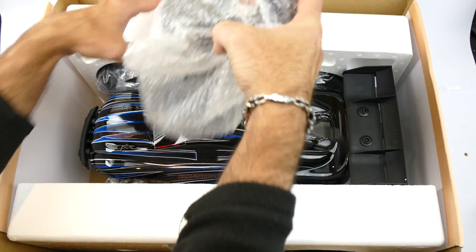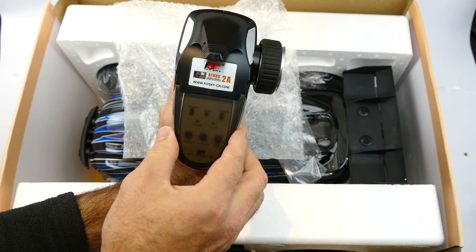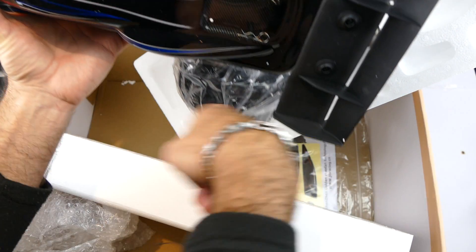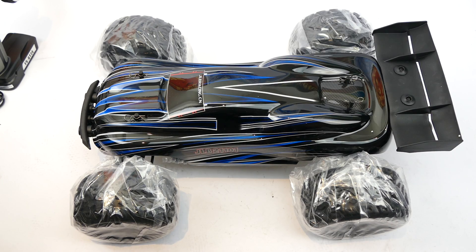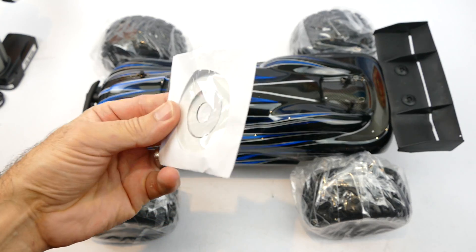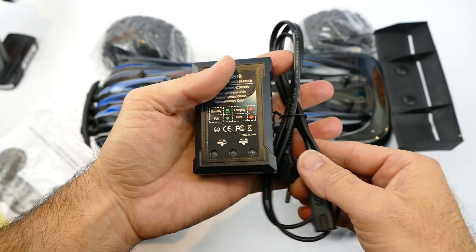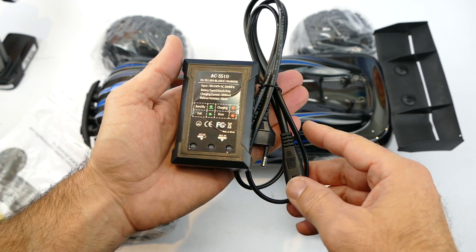I'll pull out everything that we get in the kit. As you can see, it comes with a nicer Flysky transmitter - excellent stuff. The range on the older version wasn't the best. You get a small CD or DVD, and here's your 2S or 3S charger for your LiPo battery. You charge via the balance lead. This is good to get you out of a bind, but I would definitely recommend buying a decent hobby-grade LiPo charger, because this might take three hours to charge and nobody likes waiting.